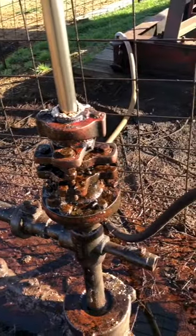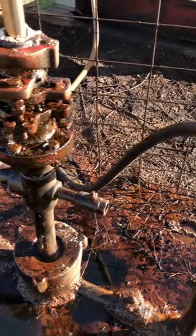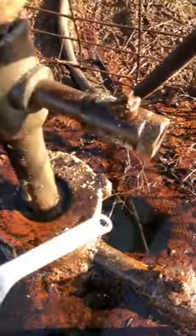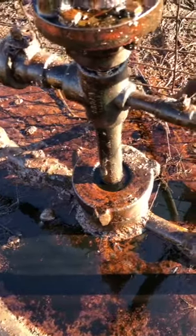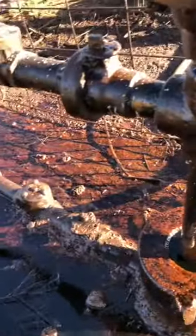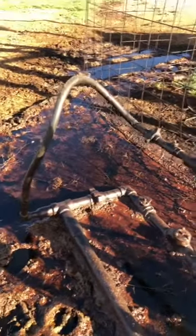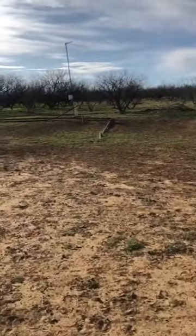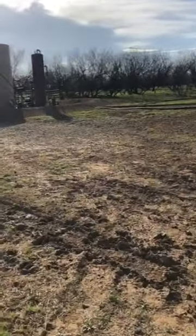You want it to come out a tiny tiny bit because you don't want it to burn up. So you got your wellhead and tubing, and you got your rods inside. That's your tubing, and this is your casing right here — four and a half inch casing, it's not big casing. Typically the fluid comes out of the tubing and then the gas and stuff comes out of the casing, and they co-mingle right here and go through this line over to the separator.